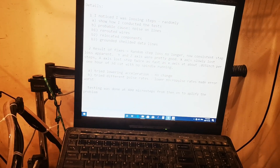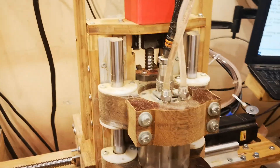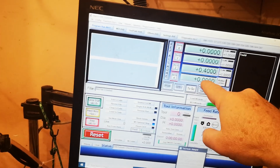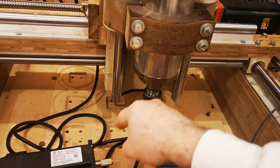When I first started having problems it was random. The way I started checking it was to put a mark at the top of my coupling nut on all three axes — X, Y, and Z — and on the screw since I don't have a see-through cover. That allowed me to start at a zero-zero point. In Mach 3 I'd set zero zero, and my Aspire program puts everything 400 up for the reference plane, then I would send it off on a program to do a three-dimensional cut in the air.